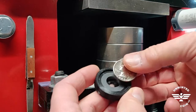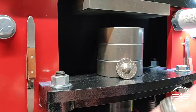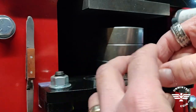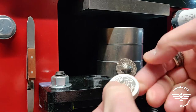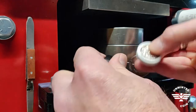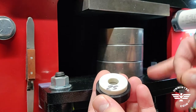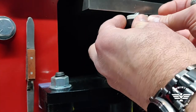So I'm going to show you how that works. This is the one for quarter — you can see it's sized to match the coin, and the center washers from the sets fit right in there. It sandwiches in and holds the ball bearing right over the coin where you need it. You just take the center washer, place the coin into it with the side out that you're planning on doming, then take the doming puck and drop that on top. Now you've got the coin centered right over that steel opening — just drop the ball bearing in and press.